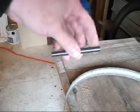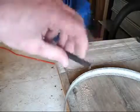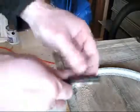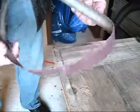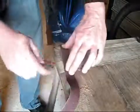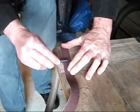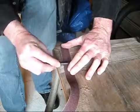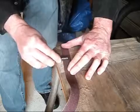You don't want to sand this on the electric sander. You're going to have a serious fire going on. But you do need to rough this up and get rid of the black coating. So what I do is I just take my little belt. I think it was 80 grit. And do about 3/4, and just rub it slow. Like I said, if you sand this too much, you're going to get sparks. So you just want to scuff it up real good. Don't go too fast.